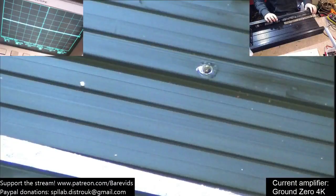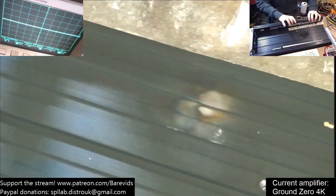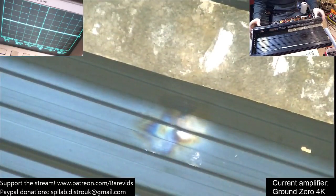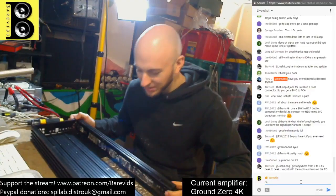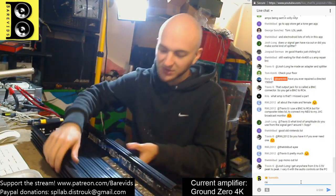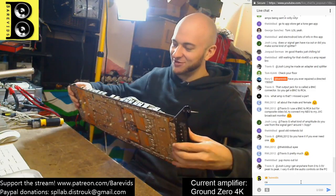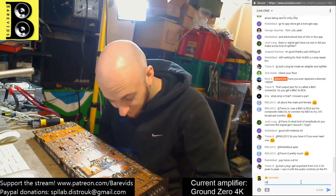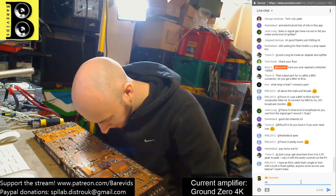It's always good to look for telltale signs. If I can get the camera zoomed in here - that has obviously had something go bang on the underside of the board. If I flip the board over we should see something very interesting on the bottom. There are some other marks as well on here, all in the power supply section. Let's turn the board over and see what caused that great big explosion mark.